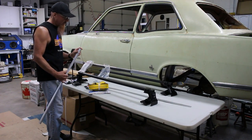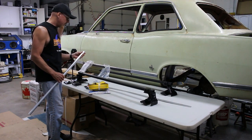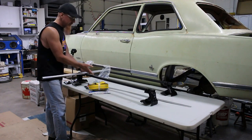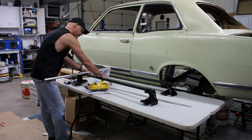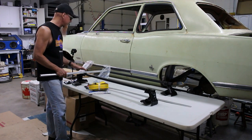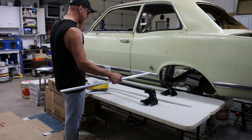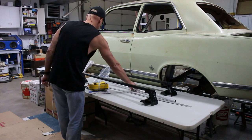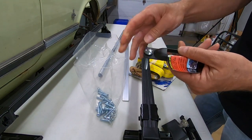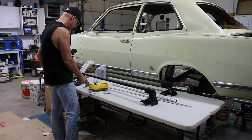Because I can't exactly weld a steel nut onto the aluminum, we'll use a rivnut. We'll figure out the spacing so the tires can drop in — we don't want them too far apart where the tires drop down and hit the roof, and we don't want them too close together where the tires aren't stable. I think we're going to be somewhere around 17 to 18 inches. We'll cut a pair of these things, drill some holes, weld the caps on the end, put some rivnuts in, and put it all together. I've got carriage bolts for the e-track's square holes — nice clean, aerodynamic look.